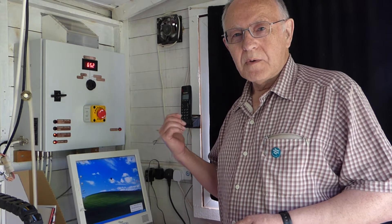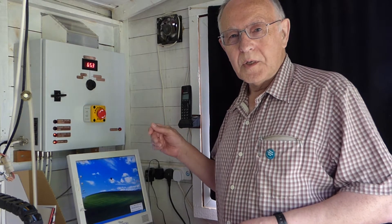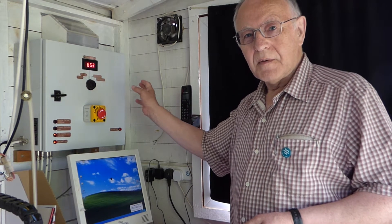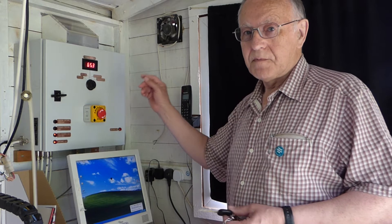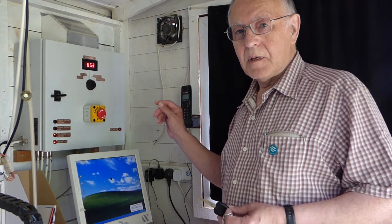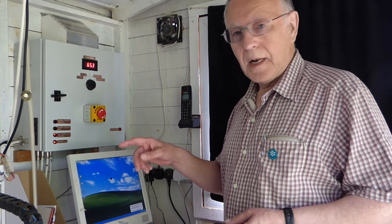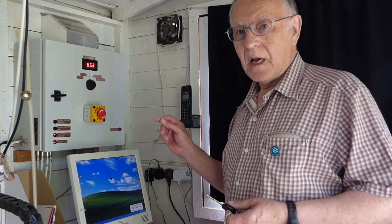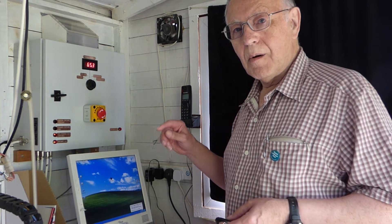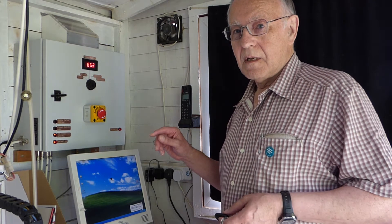Hello there. Now that the machine is all put back together, I'm now in a position to do some tests. The new power supply has a lowest voltage setting of about 65 volts and a higher setting of around 88 volts. I've tried it on 72 volts and it runs quite well, but I'm a little bit concerned about the little NEMA 23 motors overheating at that voltage. So I'm going to perform some cycle tests to see how hot it gets and how fast it gets to that heat.